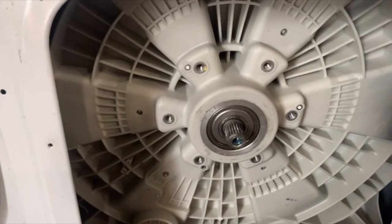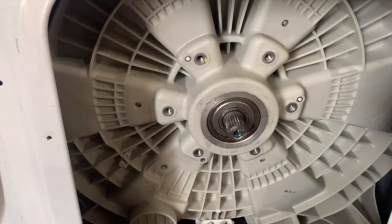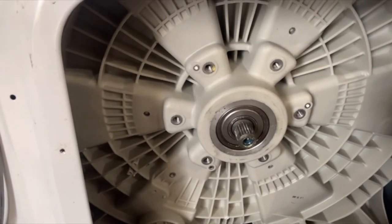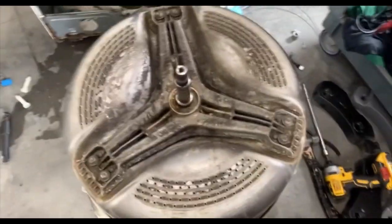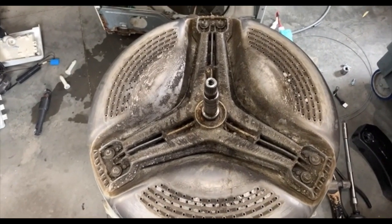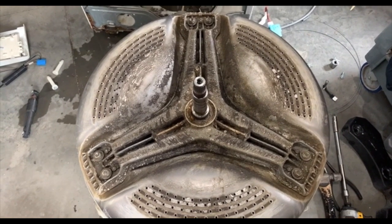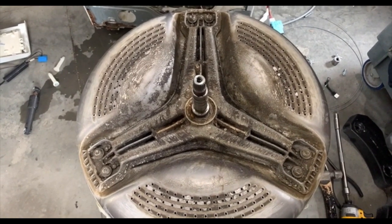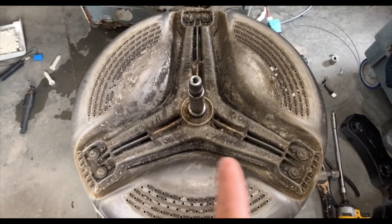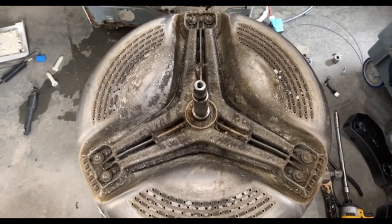To make your own parts you usually need some kind of lathe or mill. The back side of the washing machine drum — the part called the spider bracket or spider brace — is what hooks right onto that back magnet that spins on the stator. It might be worthwhile to keep that and use it to mount your blades. I'm not sure yet if I'm going to be using that, but it's a good idea.